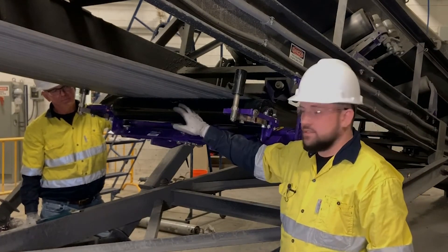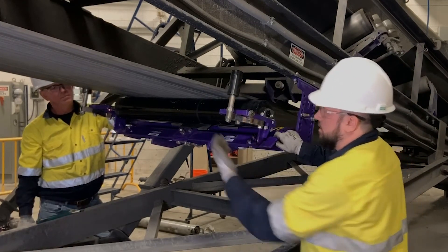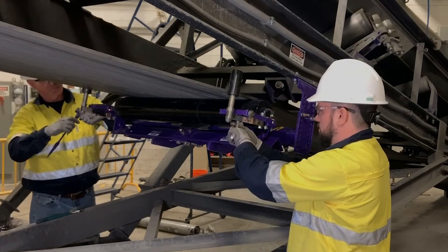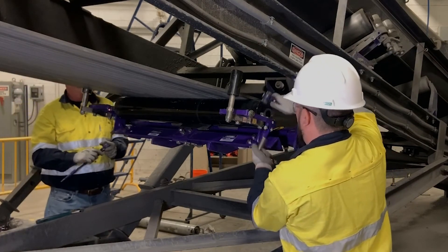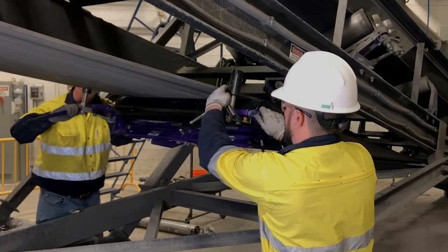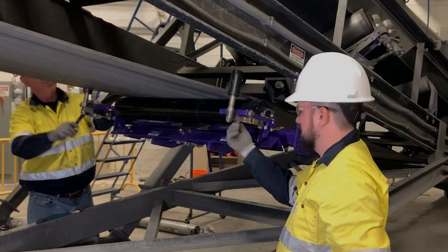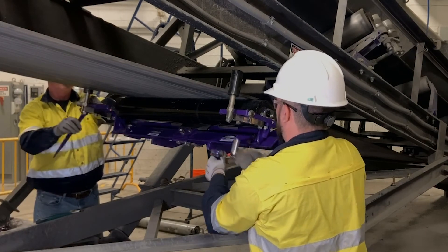In this instance, the belt is mistracked to the off side. So what we'll want to do is pivot the unit up one half inch on that side and adjust that sensor in until it just touches the belt. On this side, we should have a one inch gap. To adjust the sensor, we'll first need to loosen the locking bolt and loosen the pivot bolt. Then we'll use the adjusting screw to go either in or out. Once we've got our desired gap, we'll tighten the locking bolt back down, as well as the pivot bolt.